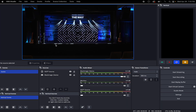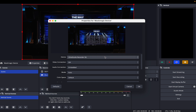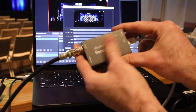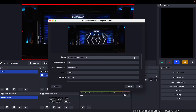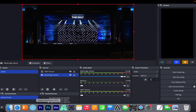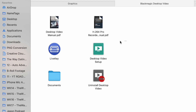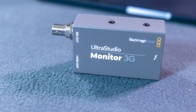Inside of OBS, I have our main output set up. The first thing we need is video. I've got my Blackmagic Recorder 3G connected with an SDI link coming in from the camera, and a USB-C connection going into the computer. Create a source — a Blackmagic source — once you have the software installed for the Recorder 3G. I recently did a video about the UltraStudio Monitor 3G, which is an HDMI/SDI output device. The Monitor 3G is for video output; the Recorder 3G is for video input, but the software and setup process are the same. It's a great tool to have in your kit.